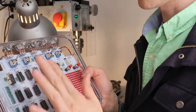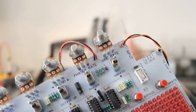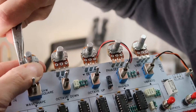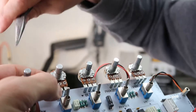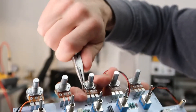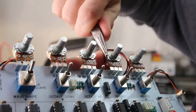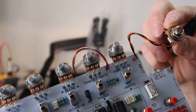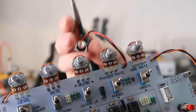That way it's perfectly aligned with how everything's set up. Another thing you need to do to fit these in the case is snap these little tabs off of the potentiometers. They're for making sure the pot doesn't rotate as you turn the knob, but you have five pots here, so there's nowhere for them to rotate. They're soldered to the circuit board, so we can just snap these off with a pair of pliers and then they'll fit flush with the plastic top. I also haven't drilled the holes for the power jack yet - I need to decide where it's going.